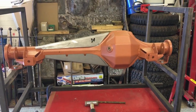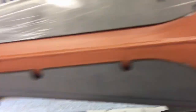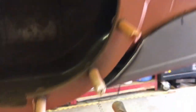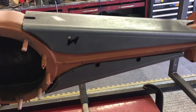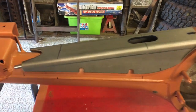There we go, that's all fitted up now — that's upside down as you're looking at it. We've got a nice parallel weld here, nice parallel weld there on the bottom, and then the end where the cutaway was for the anti-roll bar mount is sorted so it's all symmetrical now. I've got all the lines parallel and the weld is ready to go around the diff flange there. That's going to be it for now — I need to weld up the hole where the breather goes and get the other one drilled and tapped, and I'll be back.